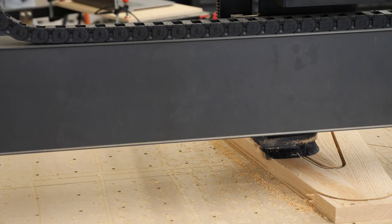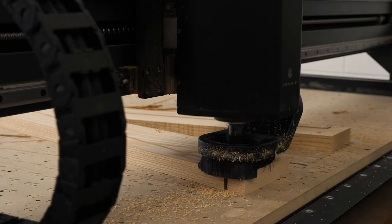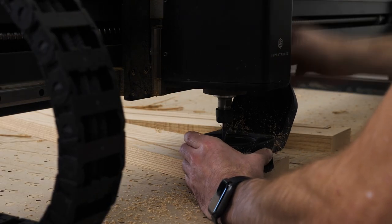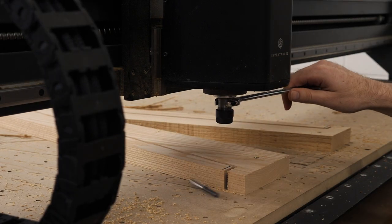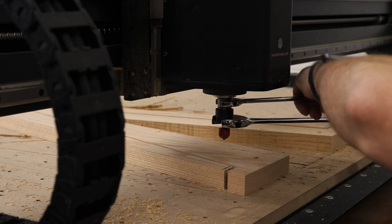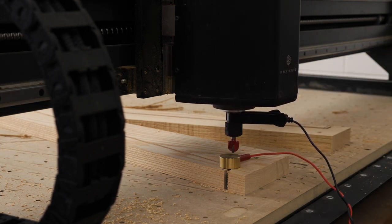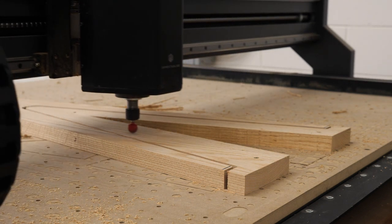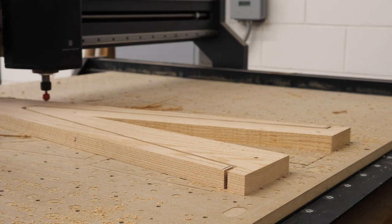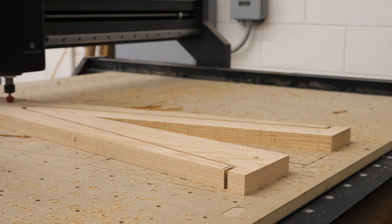So here I am making it work. If you want to see how I normally go about this, I'll link a couple of key videos where I use this workflow the more manual way in the description. After I had routed the shape out with a quarter-inch bit, I swapped that out for a round nose bit — basically a bit that cuts a three-quarter-inch half circle. In my file, I set it up so it would route four dados going across the inside face of each of the leg sub-assemblies.